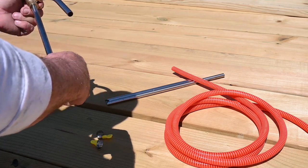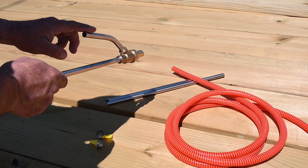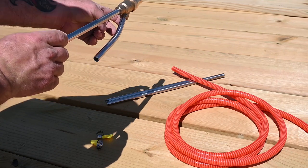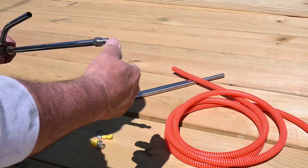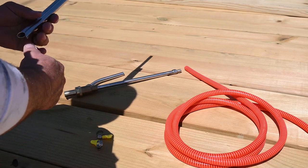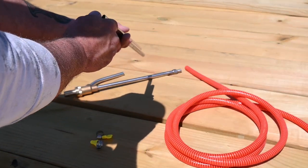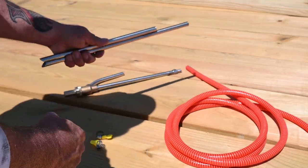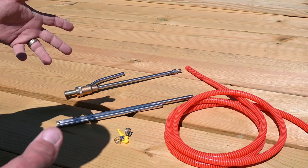And then the siphon. It also says, and make sure you look at the instructions, that when you're spraying, this hose needs to be above the actual water line. If not, it's going to push water back through and blast water into your sand. And then the pickup tube. You can see it's got an opening for a second tube on here, rather, to allow air to pull in as you pull media out as it's washing. Then, of course, a couple little clamps. That's all there is to it.